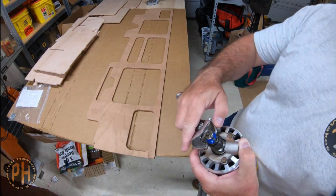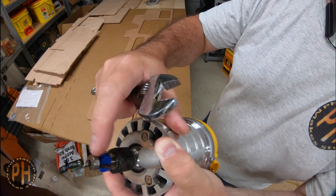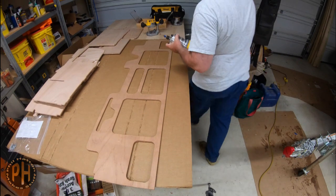Keep in mind that it's pretty likely that at some point your galley flat will get water in it, and if you don't seal all the holes in the galley flat, when the water gets into the plywood it will not come back out. Third: set up your router and test it using scrap wood to make sure you aren't cutting too deeply. You can always go deeper on the next pass.